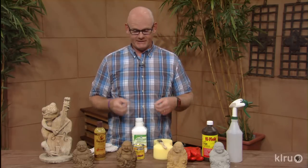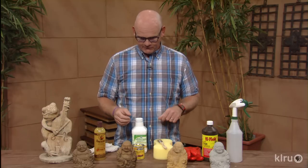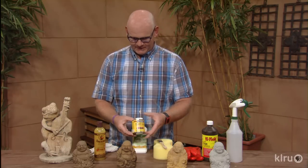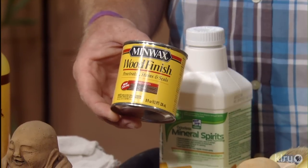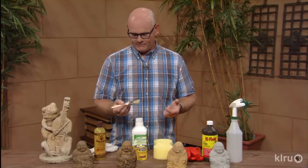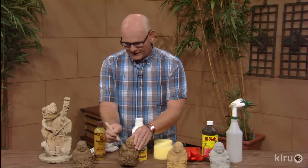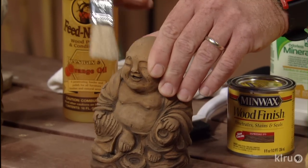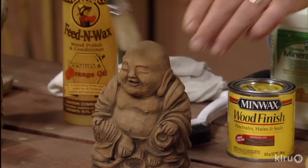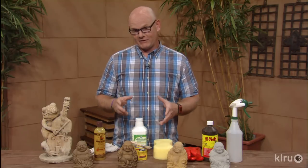For our next step, we're going to need to move fairly quickly — you don't have to rush, but don't stop and go check the sports scores. The first thing we're going to do is get some wood stain. I chose a color called espresso because it was nice and dark, but there are so many different colors out there. We'll take a simple paintbrush, dip it in the wood stain, and apply it evenly across the entire piece — all the way down in all the nooks and crannies. When you first do this you may be a little surprised, as it's going to be very, very dark.